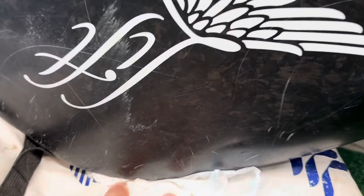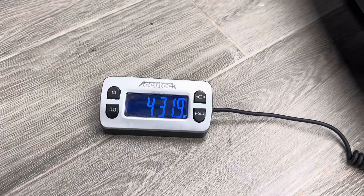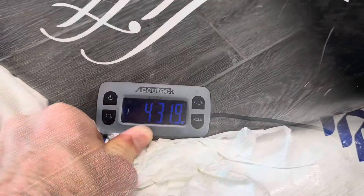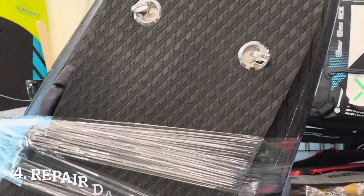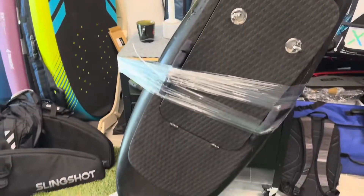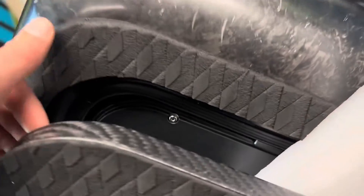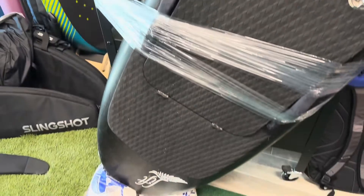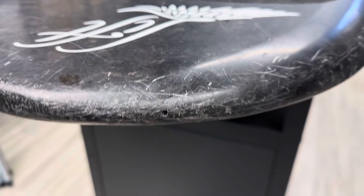We left it for another day and the low weight mark was at 431 ounces, so we lost almost two cups of water out of there. I also twirled up paper towels and stuck them in the antenna hole to pull out as much water as possible. I ended up drilling a small eighth-inch hole in that big crack at the front to help maximize water drainage. Now we're ready to move on to repairing the holes — the big one first, then the two smaller ones.